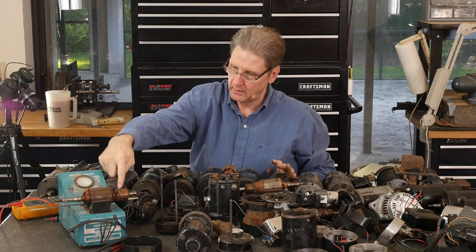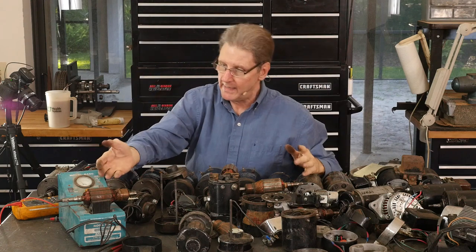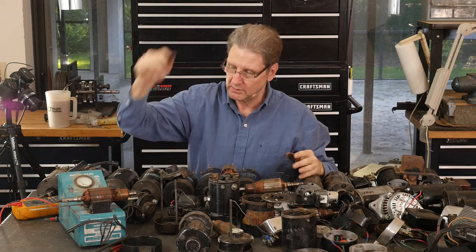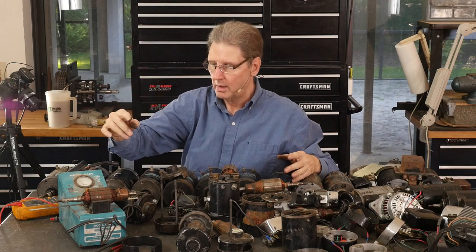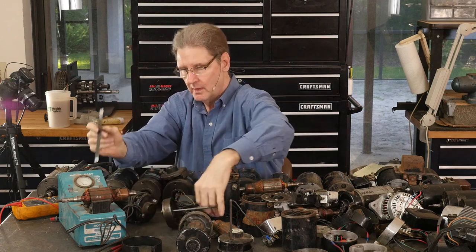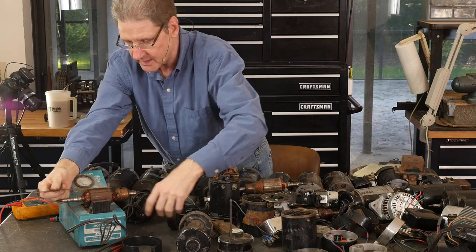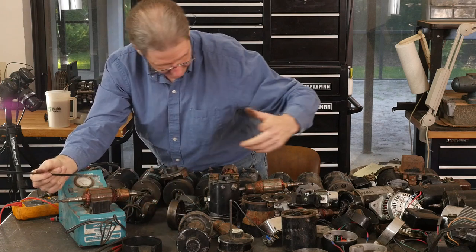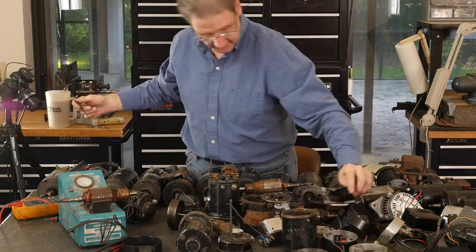This thing is a growler. It's got a coil and two big magnetic poles here, and just hooks up to line voltage, 60 cycles. That's throwing the magnetism from these poles, gets transferred here, and makes voltage here. You can check for shorted coils if it's got shorted windings in it. When you turn it on and rotate it, see, nothing happens. That's good. That means there's nothing, and you can go around. If it has a short, let's just find something to short this with. Too organized.